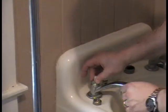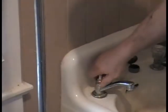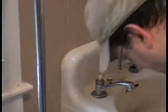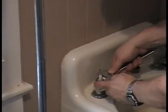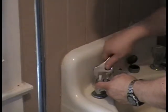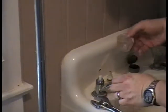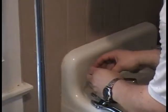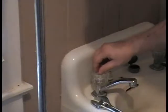There are notches which match up. We replace the nut — not just finger tight, you need the wrench, but not too tight either. Too tight will strip it. Then we put the handle back on. Once we finish repairing the other faucets and turn the water back on, we'll make sure everything works the way it's supposed to.